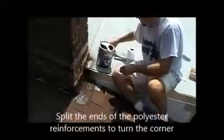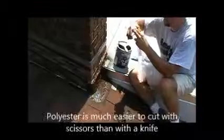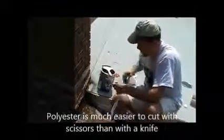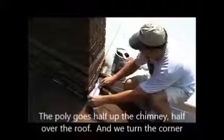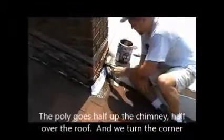Also, if the product has been in the can for a long time, it might be a smidgen thicker, but I've used product that has been as much as 3 years old unopened, and a can that has been opened and then resealed. You can unseal it, go in, and there'll be a skim coat on top, and you'll take that skim coat off and what's below will still be workable. And I've done that with a can that was opened and then resealed after 6 months.